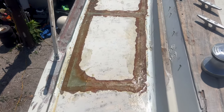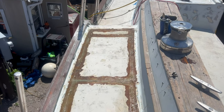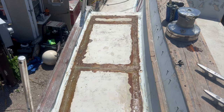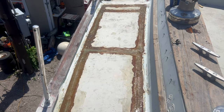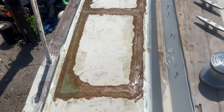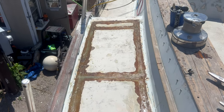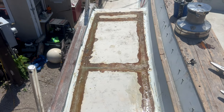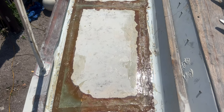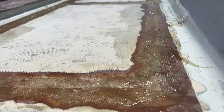I wasn't able to get any shots during the fiberglassing — I'm alone today so it was tough to get things set up. I didn't have enough time to work with the resin — to stop and turn on the camera or whatever. The resin's kicking really fast today. I had about an eight-minute work time on a 16-ounce batch. This took three 16-ounce batches and I have a couple layers of fiberglass down, kind of in a criss-cross pattern through the entire joints, all the way along.